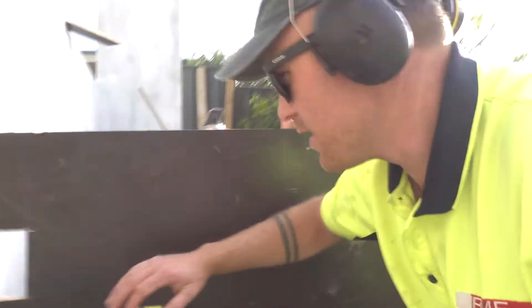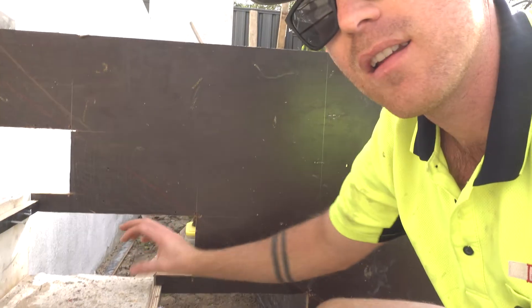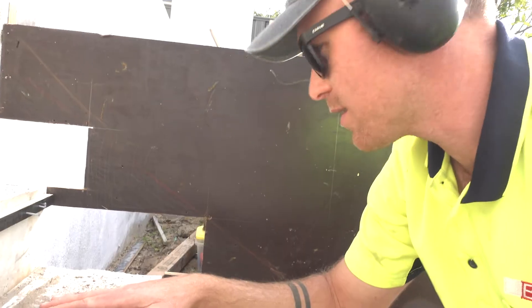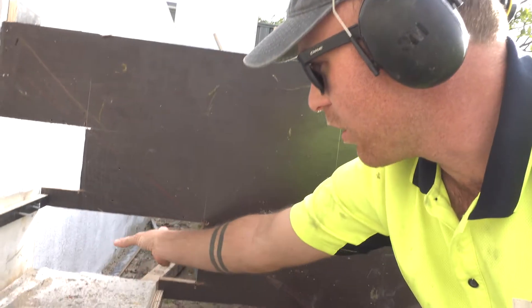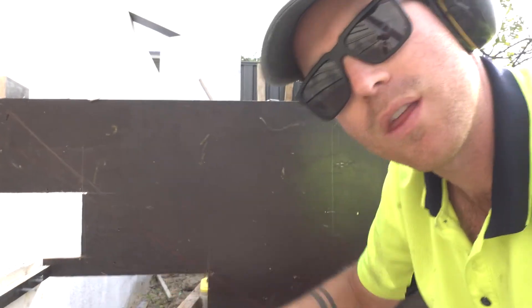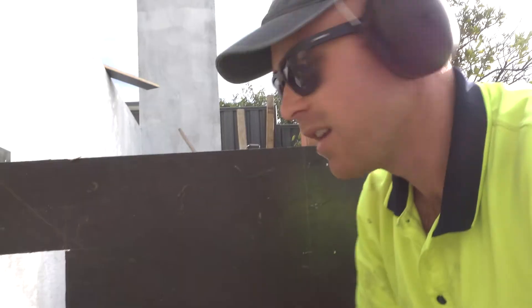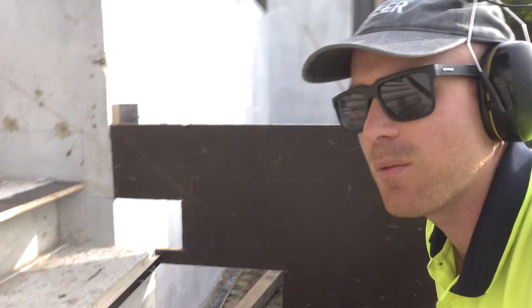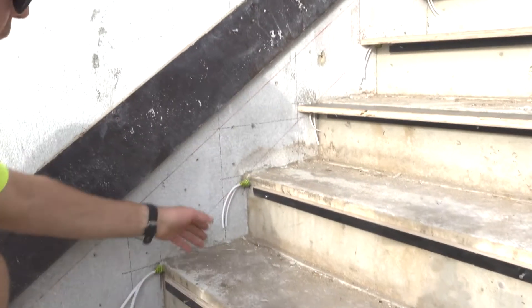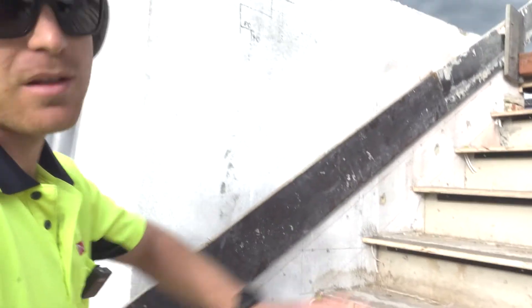So this ply is acting as an edge form for that planter, but these bits of cut out are actually going to be concrete for the stairs. So I can't have ply there because you've got concrete there and concrete here — it'll pass all the way through. It's just a matter of putting the ply there, marking your stairs, and then you just colour in where the concrete's going to be. I'll put these last few steps in. Also, these little cables are for lighting that will go on the underside of the step — at night time these will look wicked.